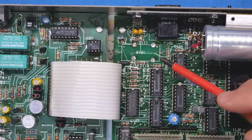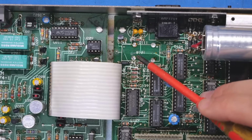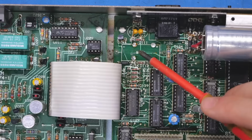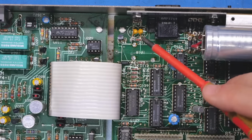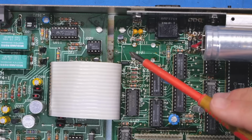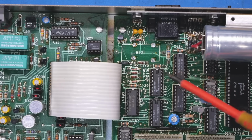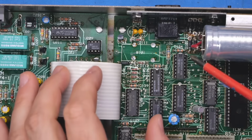And yep, we definitely have a little bit of corrosion that happened here. Now, hopefully this is all to do with the charging circuit for this battery. So that transistor there, the diode, it's probably all somewhat related, I think. I think this leakage really just sort of went off the board down onto the bottom of the case, although we're gonna have to remove this PCB to really see the full extent of it.